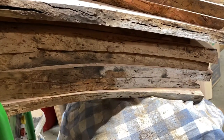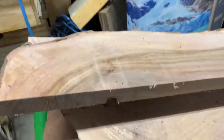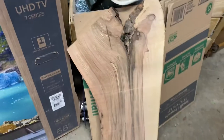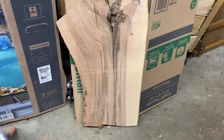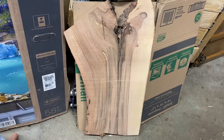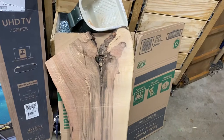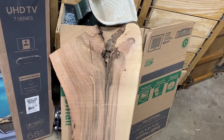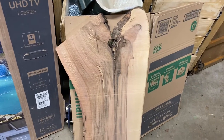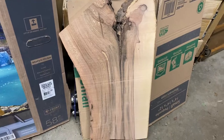This is some of the lumber pieces that I got out of this. They're all about an inch and an eighth to an inch and a quarter thick. I believe that's the largest piece there. That piece alone will probably get put in a press to let it dry as straight as I can. Put some kind of a metal clamp on front and back of metal bars to try to hold it flat while that one air dries.